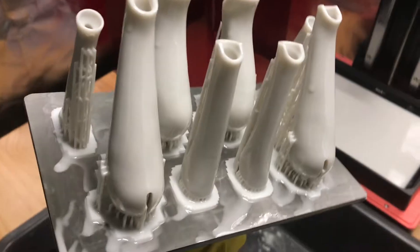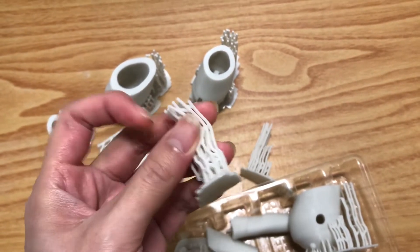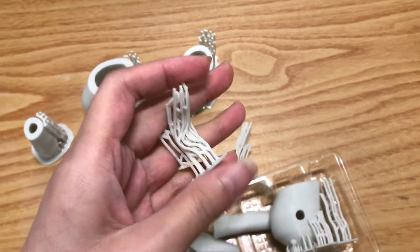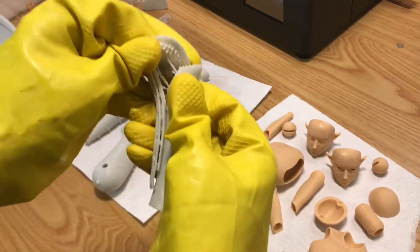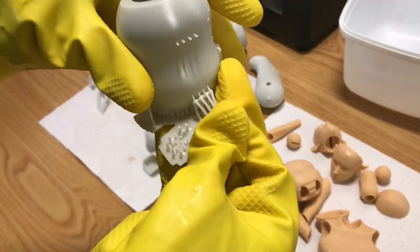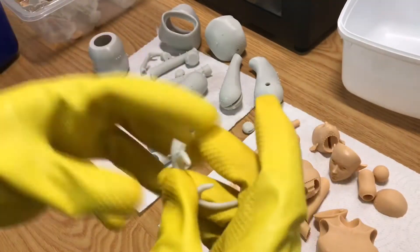Though I recognize that the darker tint may present problems if you're looking to make lighter colored models. This resin requires a little more careful timing and may not be so beginner friendly. Before it's cured, exposure to air and alcohol or solvent will degrade its quality and may compromise the scratch resistance of the surface you seek later on. Too much air or solvent and it can become soft and rubbery. Very thin structures need to be adequately supported. ResiOne advised that you can use a thermostatic drying oven to restore its rigidity and strength. Simply curing it under UV light for 10 to 15 minutes seemed to have restored its firmness.